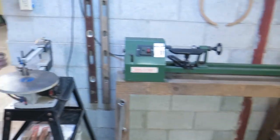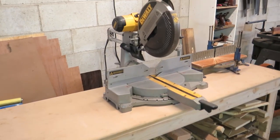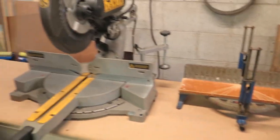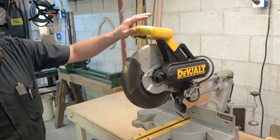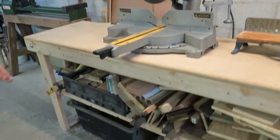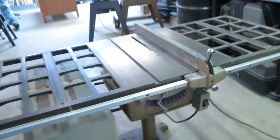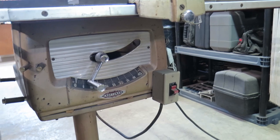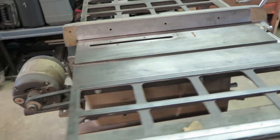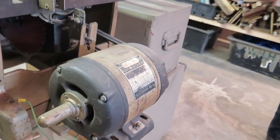This is kind of the wood shop. We've got a scroll saw, a wood lathe, and our chop saw — probably the most used tool in the wood shop. This is the old version of the DeWalt double-bevel compound miter saw, sliding 12-inch, with our wood scrap stored under here. The table saw — kind of the centerpiece of the room — is a 1960 Craftsman made by King Seeley. It's actually a nine-inch blade table saw, which we've not had a problem finding nine-inch blades for. Freud actually makes nine-inch blades that I like a lot.